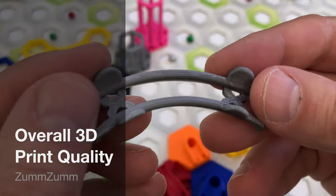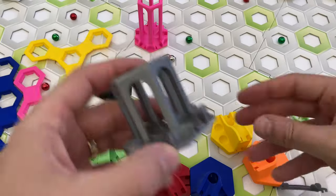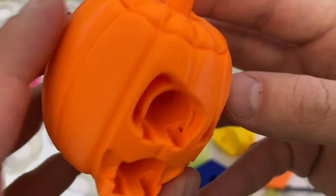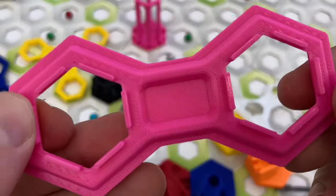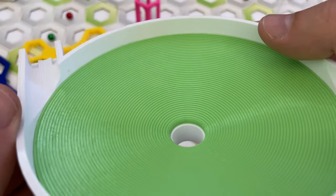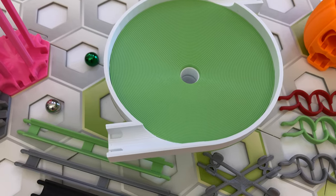Let's take a look at the overall quality of the 3D prints from the ZumZum shop. Overall, the print quality is excellent. Printed layers are precise, side walls are smooth and even, ghosting is almost imperceptible, and very high quality filaments are used. Overhangs are good with only a small amount of drooping. There is no elephant's foot. Support attachment points are fairly clean, small features like rail ends are well formed, and print bed surfaces are often glassy smooth — a tie for the best I've seen. Top surfaces are smooth with no gooping, stringing, or scarring. A couple of parts had small gaps between infill and outline, which is purely cosmetic. Overall, the prints from this shop are outstanding. I'm giving ZumZum 4.8 stars for overall print quality.